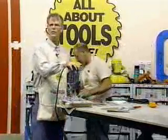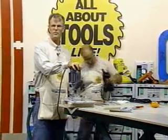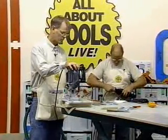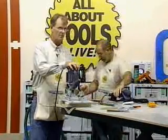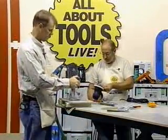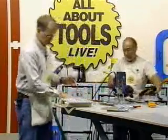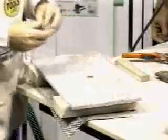We have a question. Is it proper to use a drill press to cut a plug in solid surface? Isn't the rotation too slow? Actually, no. We haven't had a problem with it at all. Most drill presses have multiple speeds, so by changing the belts you can increase the speed without any trouble. You have to be careful in some cases because you don't want to get so hot that you're putting burn in, especially if you're working with an acrylic.